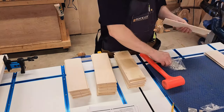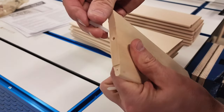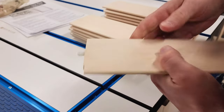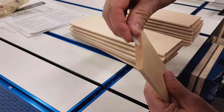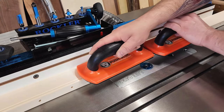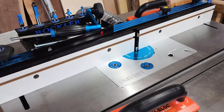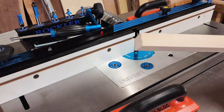Moveable louvers use a shutter pin on each end to connect the louver to the stiles. Make sure you don't get any glue on these. Each pack of 50 pins comes with six tension pins to provide louver resistance — make sure you add two or more to each shutter. The plans don't include additional stile width required for overlap between adjoining shutters; consult the measuring guide for this. I accounted for this and added rabbets to the shutters so they will meet in the middle and still block out the light.